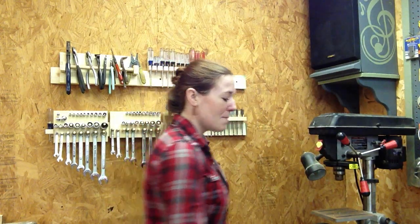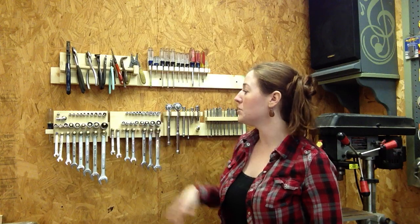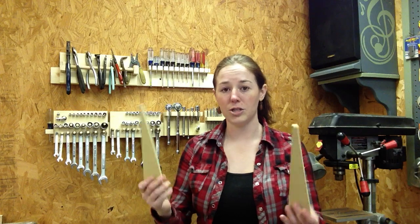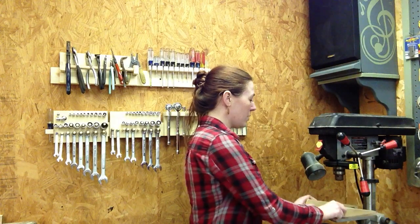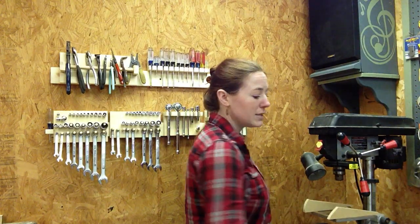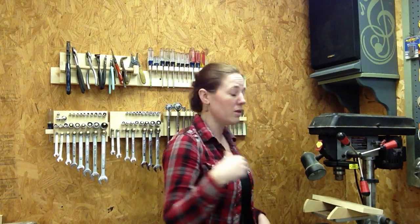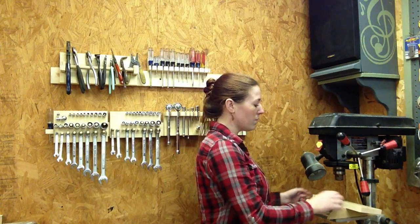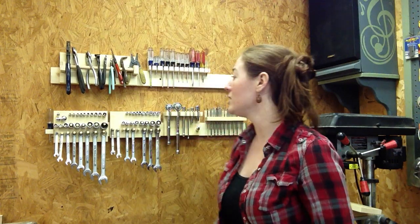Oh, real quick before I wrap it up. On these dowel rods, I'm sure that if I were to just go in at a regular 90 degrees, it would have held them just fine. But I went ahead just to play it safe and put a 10-degree angle on them. To do that, I just grabbed two scrap pieces and put a 10-degree cut on them, so that whenever I laid the back piece on the deck with my drill press, it would automatically be at a 10-degree angle when drilling those holes to store the dowel rods. So if you are going to be doing the same design, that's a very quick way to do it.